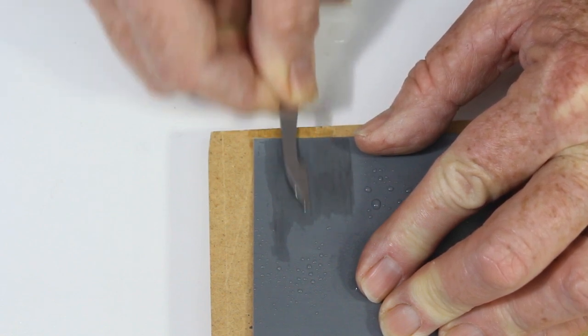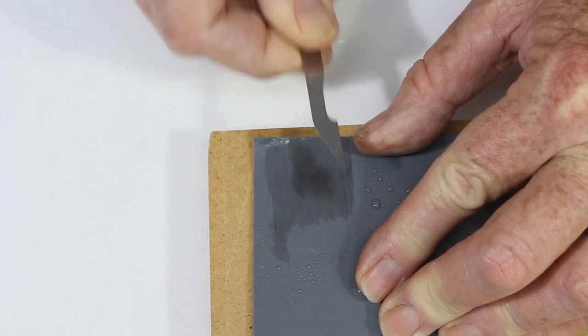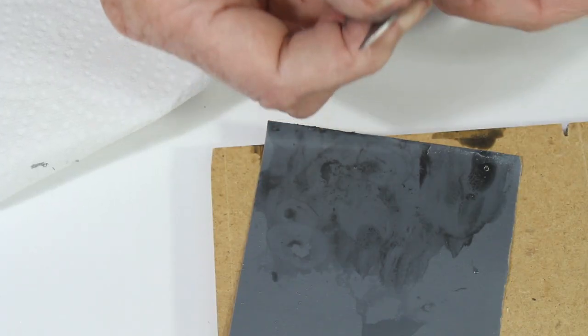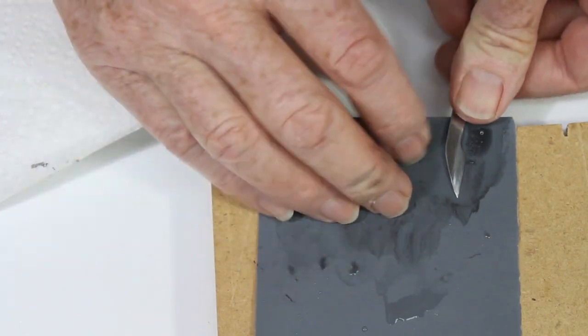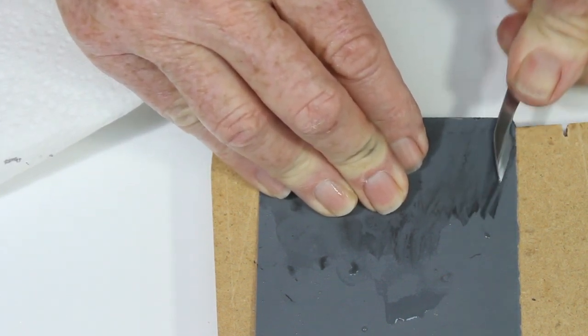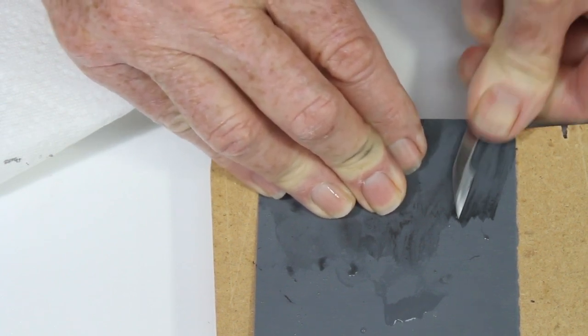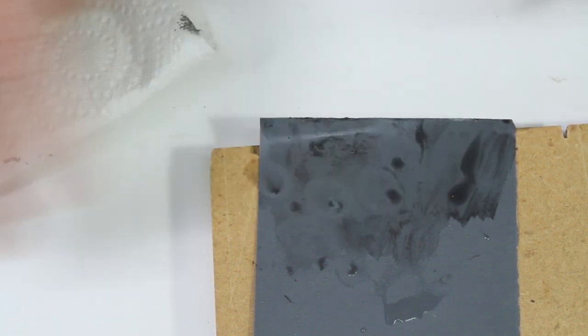When it appears completely free of scratches, go over it with 600 grit silicon carbide paper. This will polish the surface and it may reveal scratches or pits that were invisible before. Sand these out thoroughly while the steel is soft. Trying to remove them after the steel is hardened is agonizingly slow.